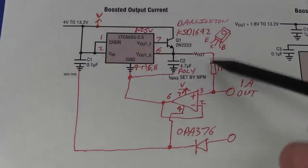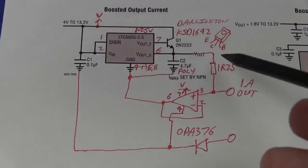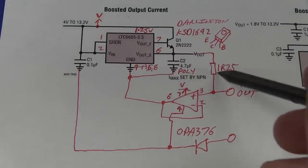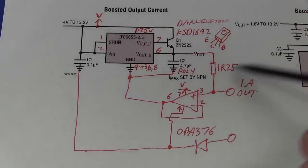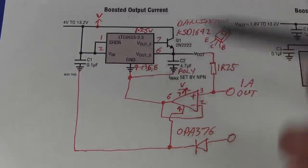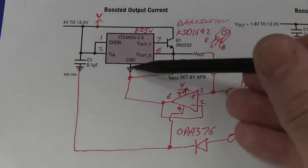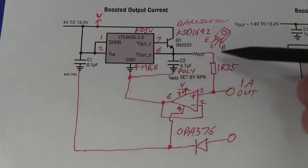In the final product I was going to have a 0.02 percent precision resistor of 1.25 ohms. And of course by Ohm's law, 1.25 volts across 1.25 ohms gives you precisely 1 amp. Now what you can do with these series voltage references is the ground doesn't have to be ground — you can actually float that above ground.